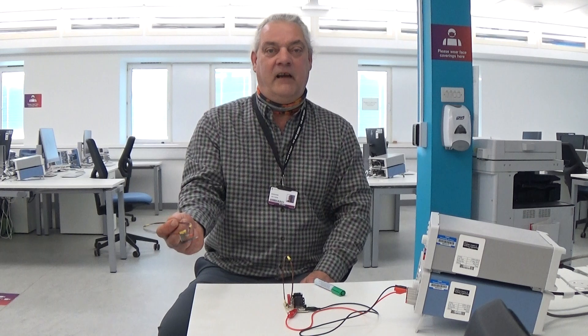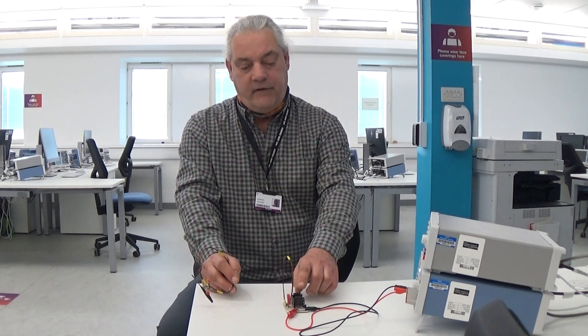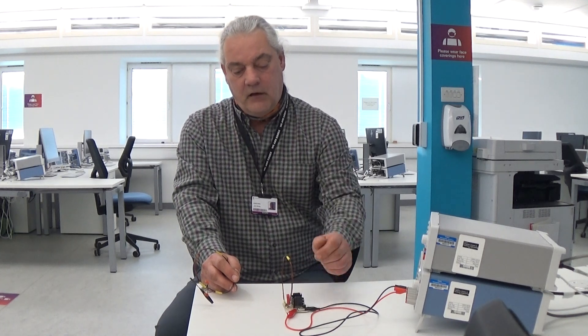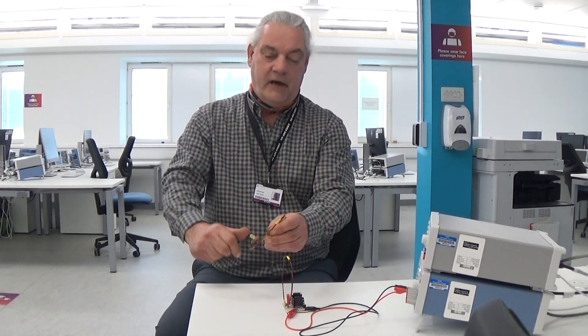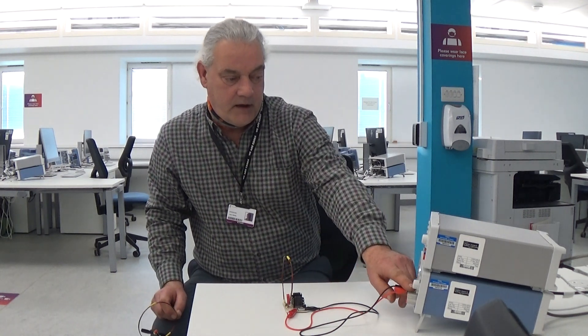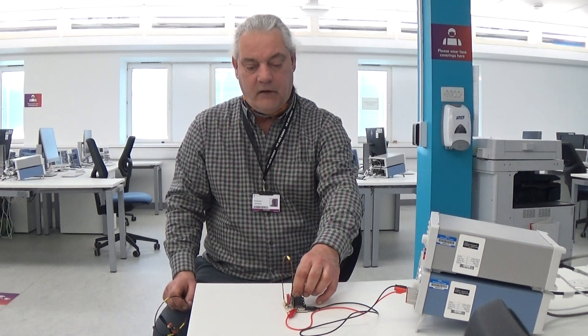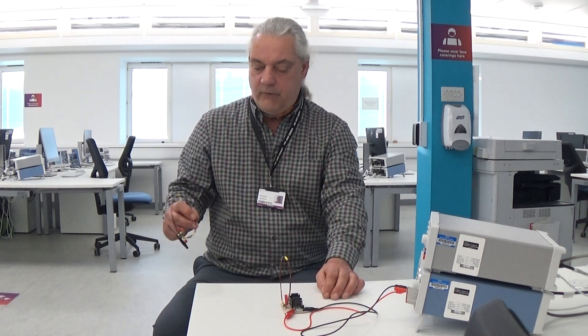What I've got here is two coils, and both of these coils are what we call resonant — they vibrate at a particular natural frequency. On this side I've got a driver circuit: just a pair of cross-coupled transistors, capacitors cross-coupled, and I've got a tuned circuit here and a tuned circuit here. I've put an electric motor on the end so we can see it rather than an LED. I've got about 12 volts going in, drawing about an amp and a half. The circuit is resonating at about 350 kilohertz, and the transistors are reasonably cool at the moment.